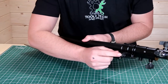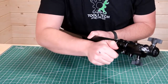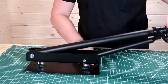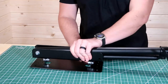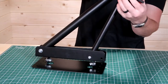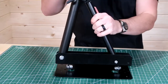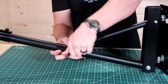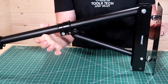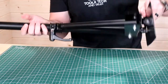The handle has a button you can push down to adjust its location so you won't bust your knuckles. If you loosen that up, it allows you to move the triangular piece, giving you basically 180 degrees of movement on two different planes. So with that loose, you can move this to wherever you want it. When you want to lock it down, just take your handle and cinch that down and it will be locked into position. You can install it either way — I prefer this orientation for my setup so I can put it close to the ceiling without worrying about the triangle piece.